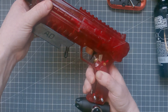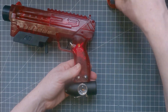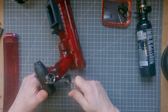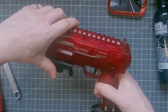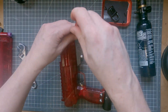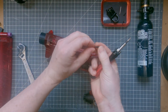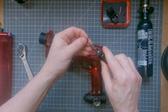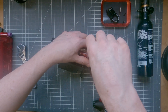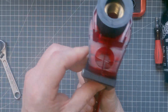I can go ahead and screw these ones on first. I've got these M5 screws that fit in here, and I've got some M2.6 hex head self-tapping screws, 12mm long, for the other screw ports. And there you go, that's all held together nicely.